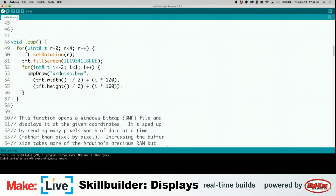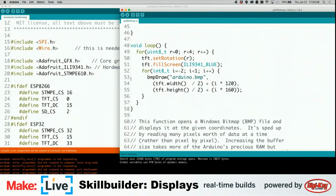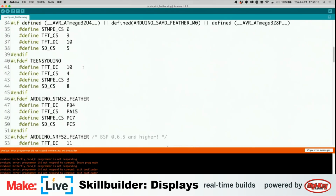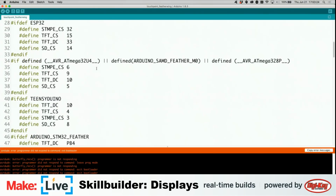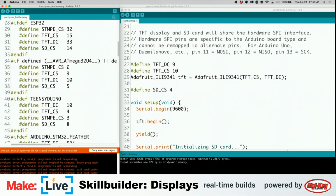All right, it says it's done uploading, and it hasn't actually begun communicating with the board yet. Well, it did say done uploading, so we definitely have the correct port. Okay. We see all the values that we need. Oh, that's for the ESP8266. So we need, here's the one we need for the AVR ATmega. So we'll need to borrow all these values and communicate them over here.